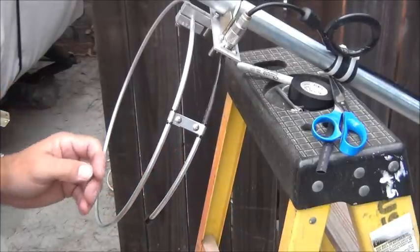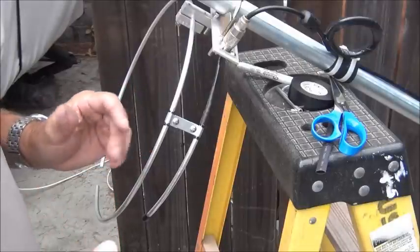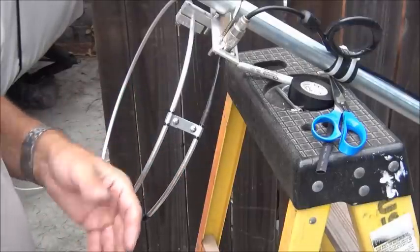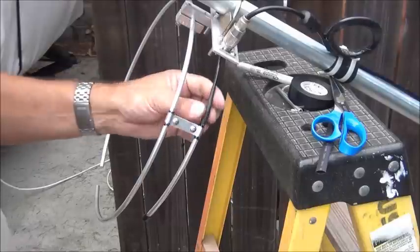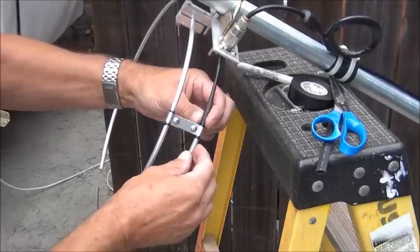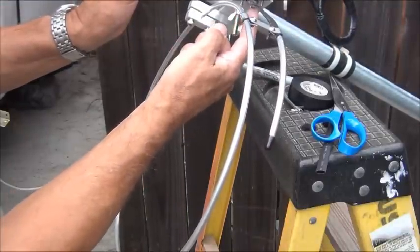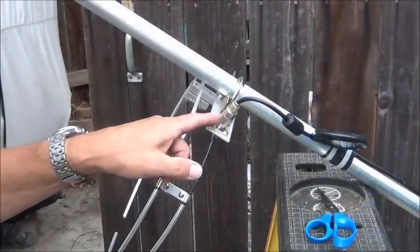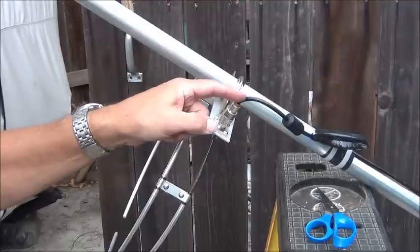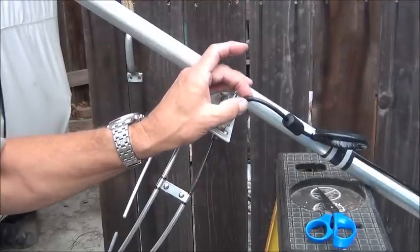This is summer in Northern California, and normally it does not rain here, but it's starting to sprinkle — kind of an unusual weather condition. Now we've got the heat shrink over the tape, that's sealed, and I've got the vinyl cap on the end. The other thing I've got to do is seal this PL259 back in here. This connector is exposed, so I'm going to go ahead and tape that as well, and put some wire ties around it to keep the tape from coming loose.